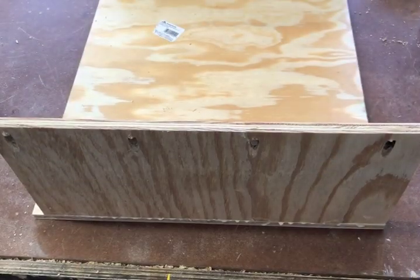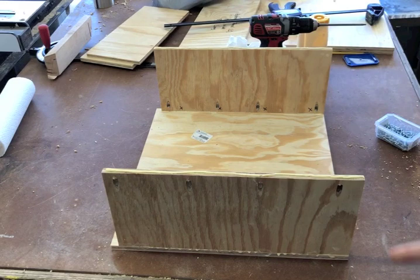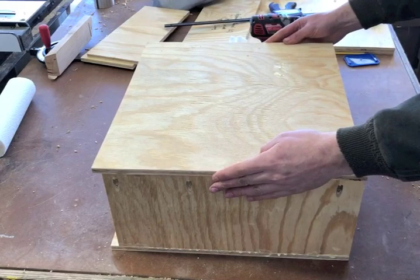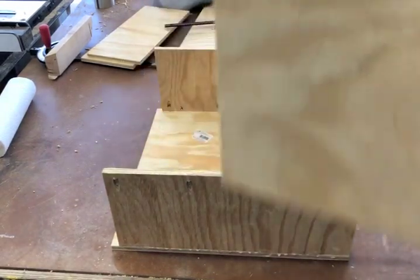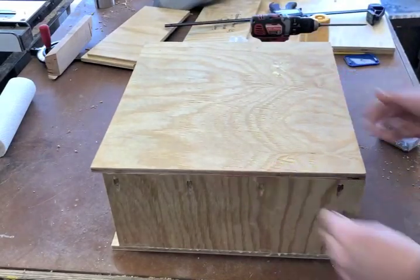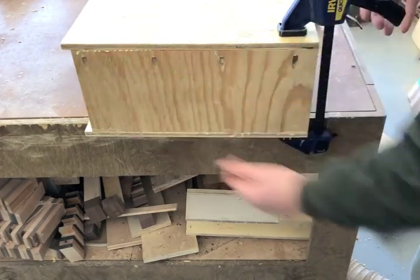Now it's time to assemble the back panel. We're going to start off with a nice thin layer of glue right here. When we were drilling these side panels, I instructed to put the pocket holes on either side, and here's the reason why: when I put this back panel on, I can drill in these pocket holes. Had I drilled all my pocket holes on the same side, I couldn't get my drill up in there to access it. Using the clamp and making sure all my corners are flush, I'm going to clamp this down tight and then put my screws in.